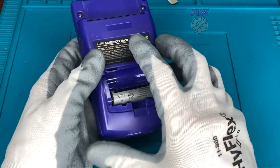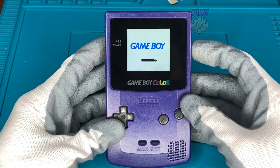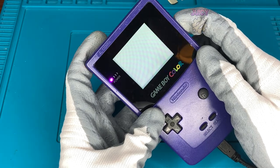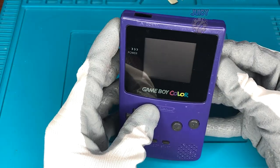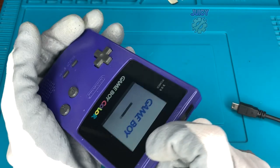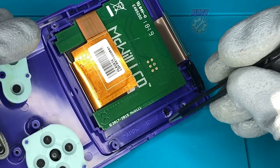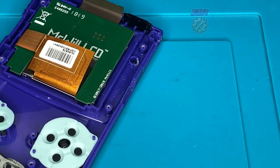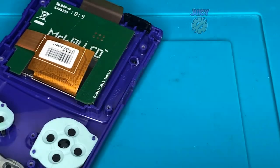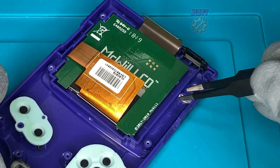The moment of truth - let's test this. I don't see the red LED. Does the purple one work though? That one does! Let me know in the comments what color you think it is. I can at an angle see the LEDs, so I'm going to open this up and investigate. The issue is there's a ring on the case and I cut it at the side because the red LED was right up to the side. I also need some kind of light diffuser - I found some little rubber feet that you stick on the underside of things, and that seems to work quite well. I've cut one to fit inside and this should do the job.